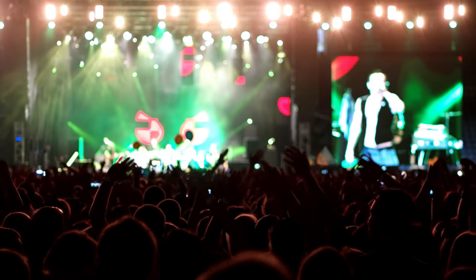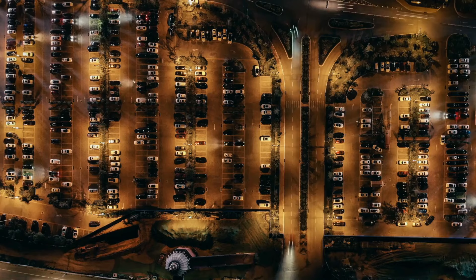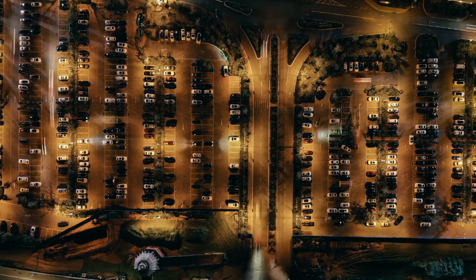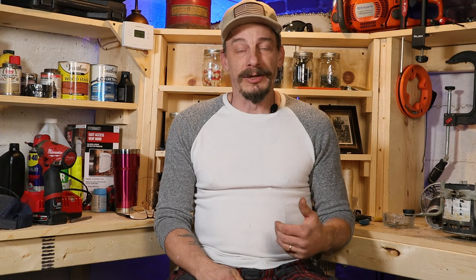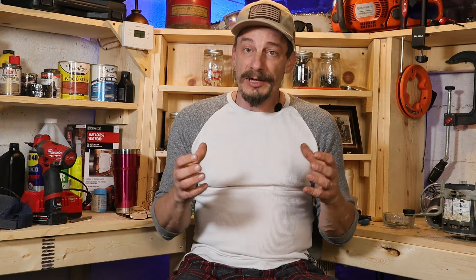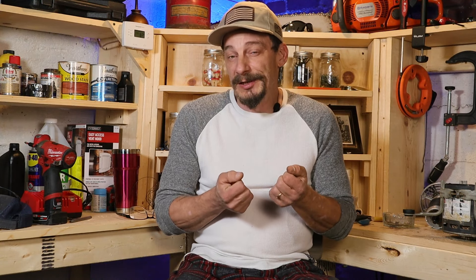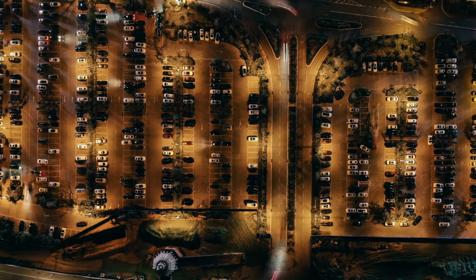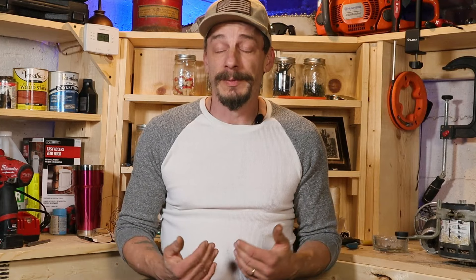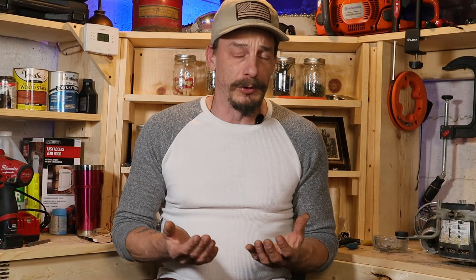If that still doesn't make sense, think of it like this: if you've ever been to a sporting event or concert, at the end everybody piles out into the parking lot trying to leave through the few exits available, and the parking lot is gridlocked. That's like using the red wire — fewer paths for current to flow through creates more congestion and more resistance. Now imagine that same parking lot with 500 different exits — that's like using the black wire, where we're using all available paths for current to flow through, creating less resistance.